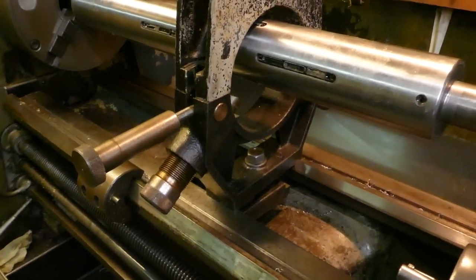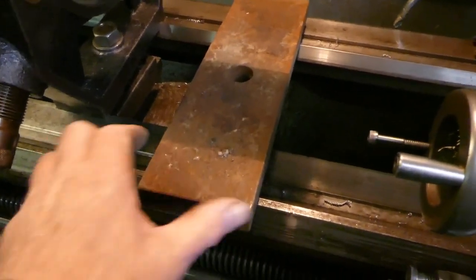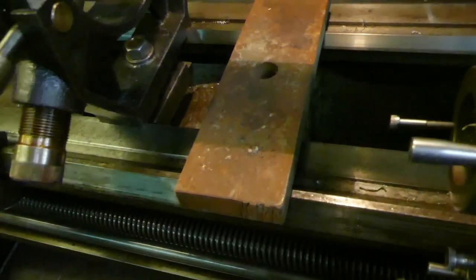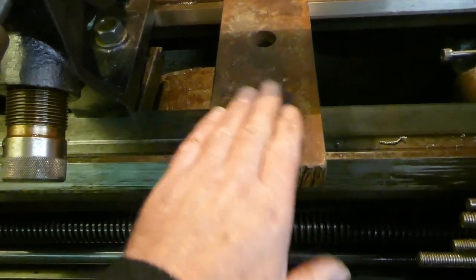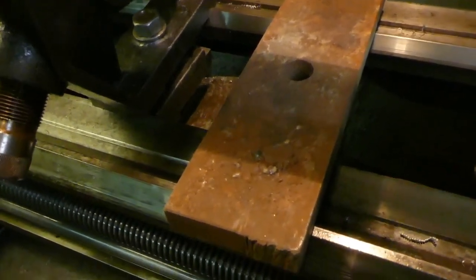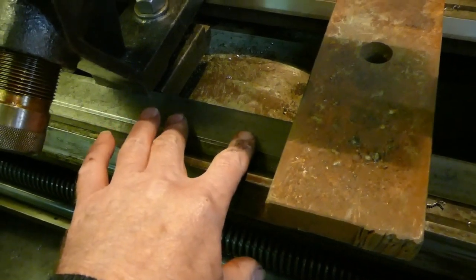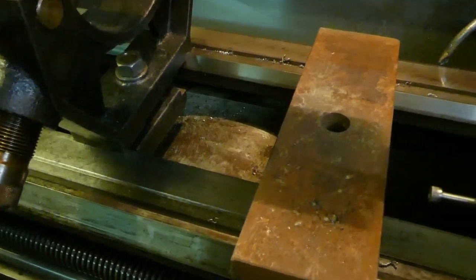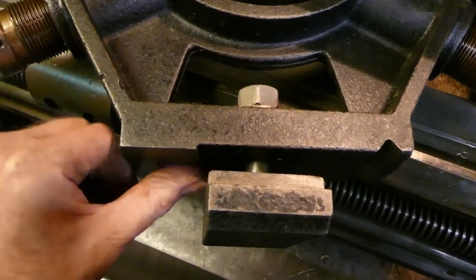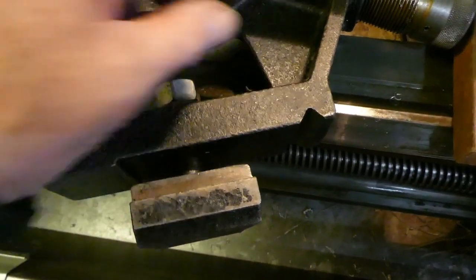Find some suitable steel. The nearest thing I can find is this horrible lump of rustiness — I think it might even have been flame cut from a big plate. 25mm thick. By the time we've cleaned the top and bottom faces up, it won't be 25mm, but if it's 7/8ths say, that'll probably work. I'll be able to just put a piece of packing underneath on this side, same fashion as the way the bottom of this steady has been done — a bit of a pad on this side, maybe a 1/8th step before it goes along and then the cut away for the V.